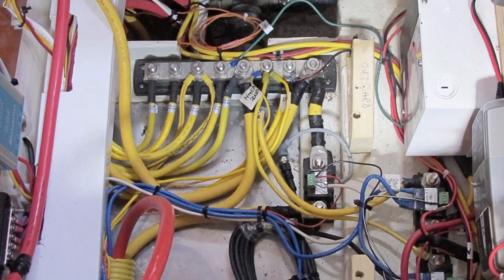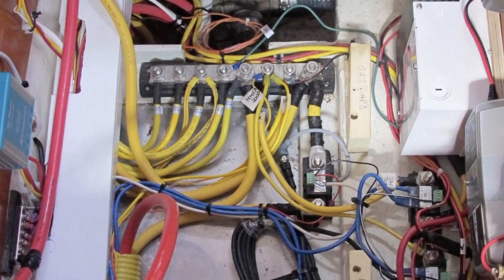And that includes — on my boat it's 12 volts and 24 volts and 48 volts. But they're not tied together at the alternator, that's for sure. Typically speaking, we have negative bus bars for the different voltages. So all of the current-carrying negative conductors end up at a negative bus bar, and the positives at a positive bus bar. And then we tie the negative bus bars to a grounding bus bar.